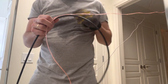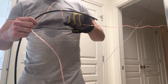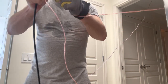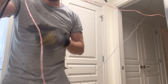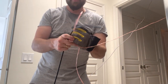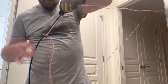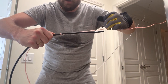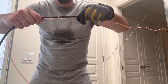The key here is to put a loop on the pull cord. The reason you do that is so that when the cable gets pulled — we've got a loop here like so — you take the pull cord and twist it, then twist it again. Then you put the cable through, and when tension is applied to the cable or pull cord, it causes the pull cord to have a tighter connection on the cable rather than slipping. This prevents the pull cord from slipping against the cable.